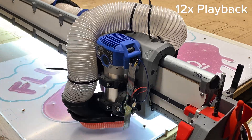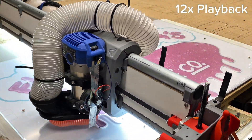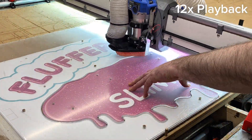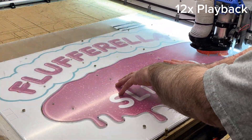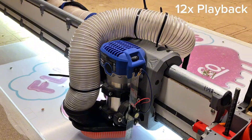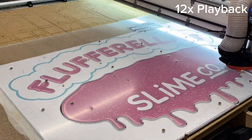I'm cutting through a stack of quarter-inch thick acrylic, then a printed sign sheet, and about a half inch or so of particle board. Right about then I realized I'd forgotten to put in some hold-down screws that I had drilled holes for. It turns out the vacuum suction of the acrylic onto that printed sign sheet meant that thing wasn't going anywhere. But I did pause the job, go ahead and put those hold-down screws in, and then continue.